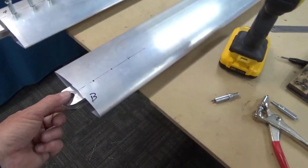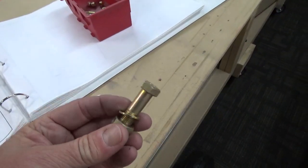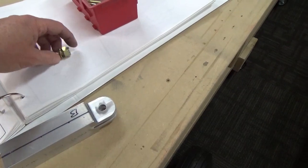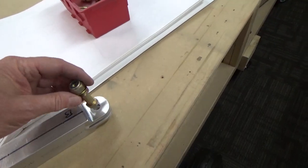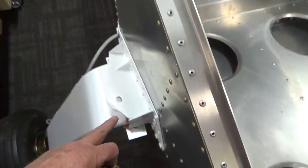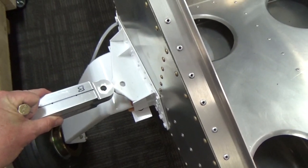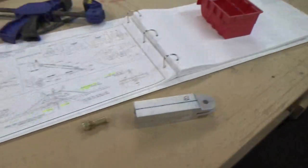It's a good time now, before I bolt these in. I've got a little chubby here — it's an AN7, so a 7/16 bolt. It sounds silly, but make sure it fits through that hole. I'll remove the powder coat, and then I'll just make sure also at the moment there's no way that's going to get on, so that's going to bite me later on. It's easy just working with this piece and I'll get that to slide on.